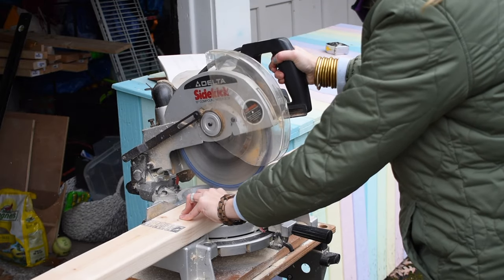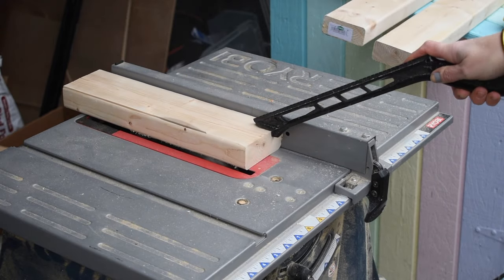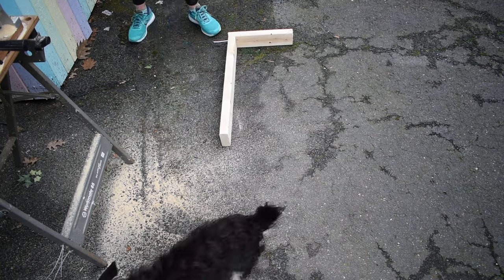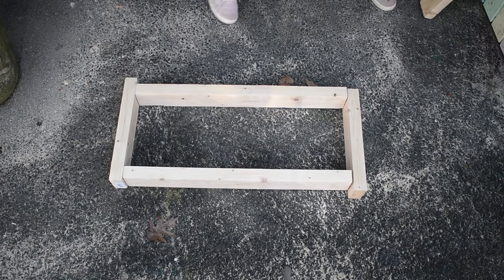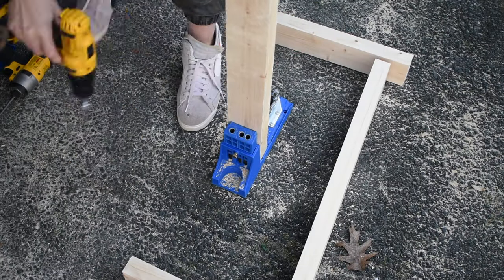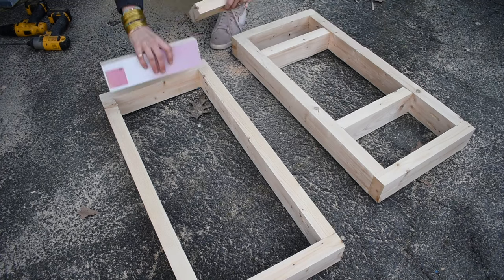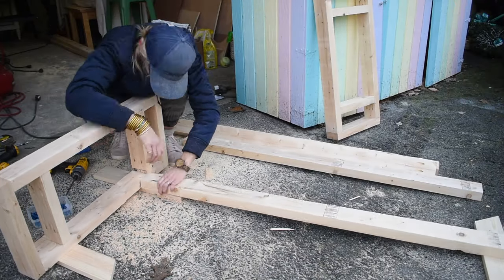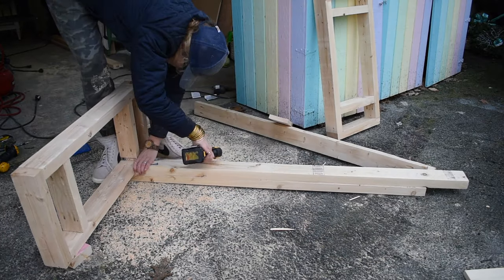For both the benches and the sofa table, I'm using two-by-fours that I trimmed down on my table saw to remove those round edges. This definitely adds a step, but the finished look is so much more polished and professional in my opinion. The legs of this table are just a basic frame that I made with my Kreg Jig and pocket holes. Once I had built either frame, I added two little shelves to support the tabletop and the lower table shelf. I eyeballed how far from the top and bottom I should install these shelves — it looks to be about four inches — and I used pocket holes to connect these on either side.